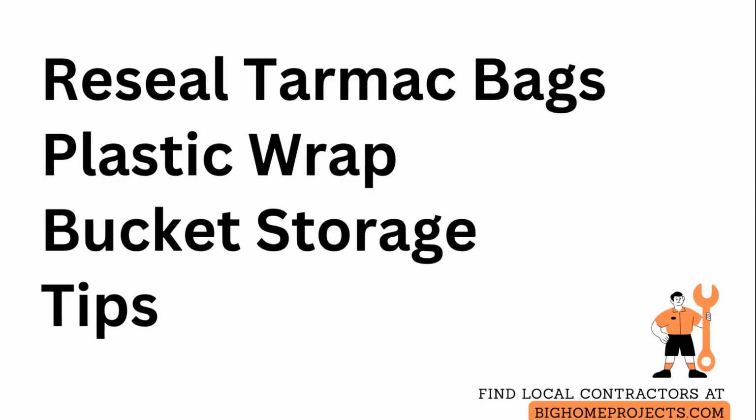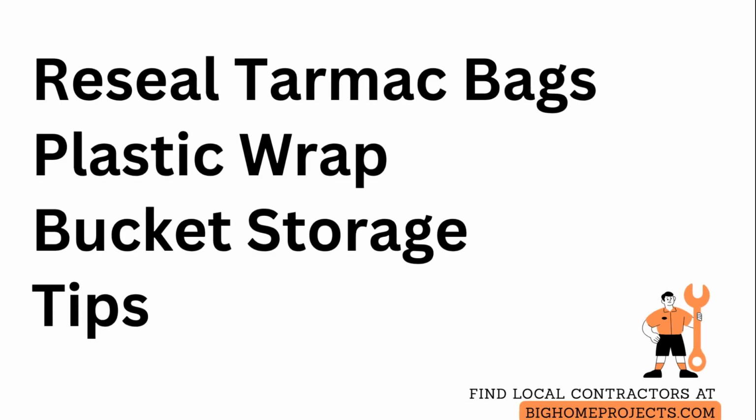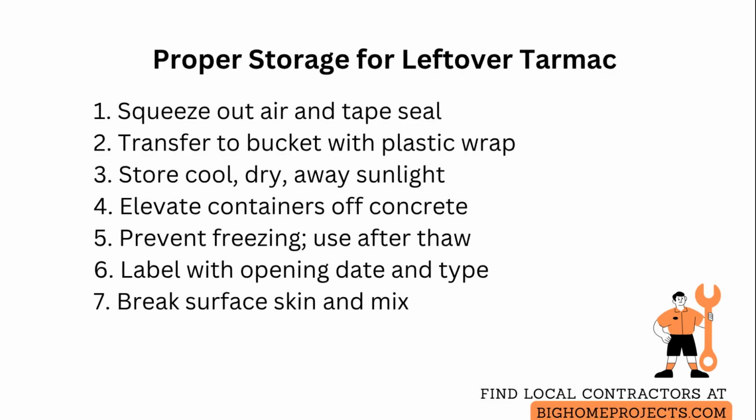Store leftover sealing or cold lay tarmac material in a way that preserves its workability and prevents contamination. For loose or resealable bags, squeeze out as much air as possible and fold the top tightly. Then use strong tape to create an airtight seal.